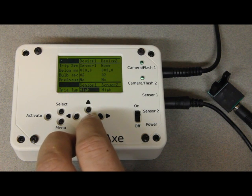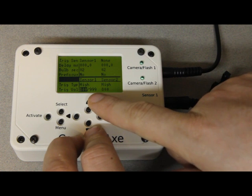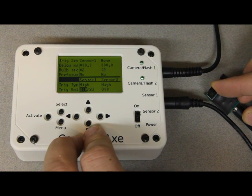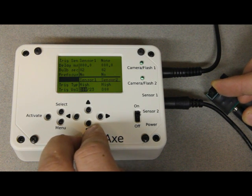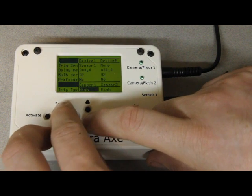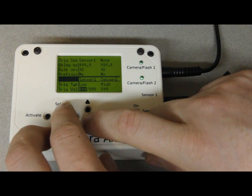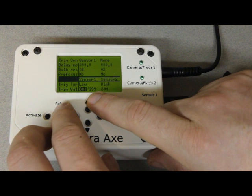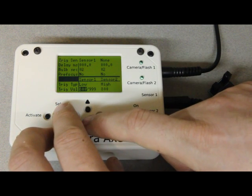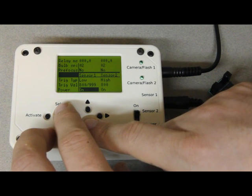The trigger type and then the trigger value — you can see that second value there, that 999, that's the current value. And if I block the PhotoGate it drops down to 23. So what that means is we want to trigger when something goes between those two posts, so we want to trigger on a low value. I'll change this to low, and anything between 998 and 23 would work. I'll just leave it at 800 — right in the middle would be 500, that might make sense too, but they'll both give you the same results. The power doesn't really matter on this sensor.